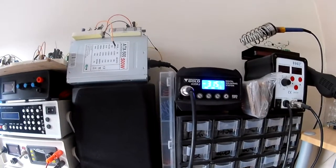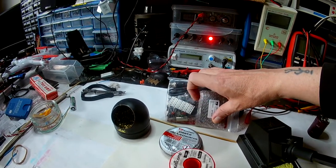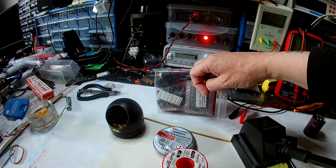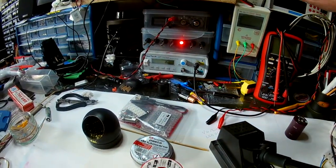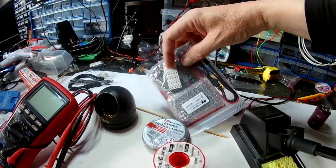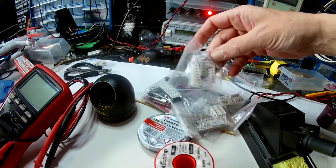When I'm building these kits, when I use it it's on for a good while. First of all I put the SMDs on - probably about 10 minutes of soldering for that. Then I do all the resistors and most of the push-through. It takes me about 2 and a half hours in total to build one of these kits.